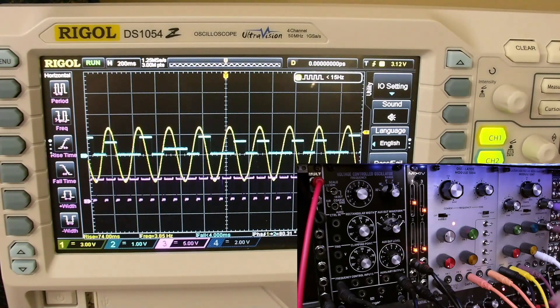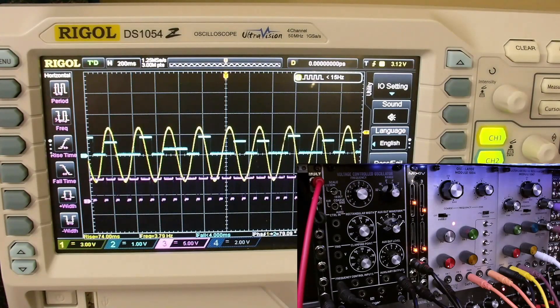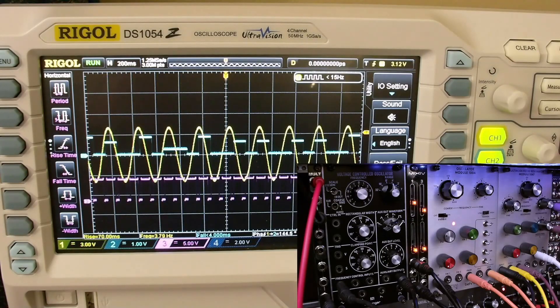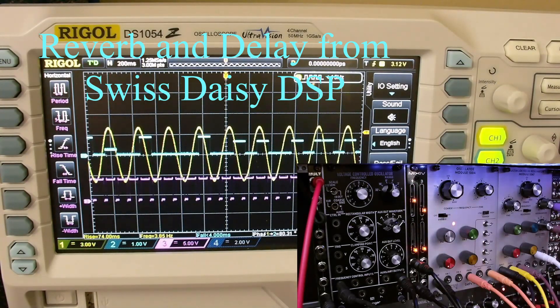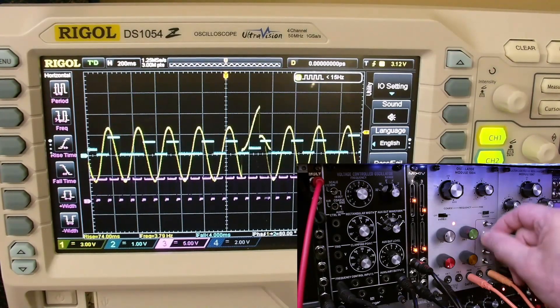The output of that is going to the 1047 module, which is a nice resonant filter that we've got in notch mode — it's mostly low pass but it's got some high end buzz in it as well. One other note: the quantizer is in a minor scale, so we get a pretty musical output.